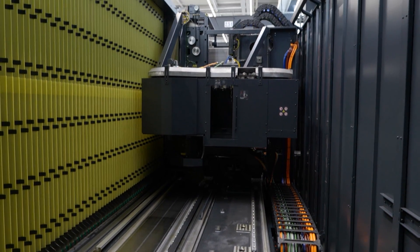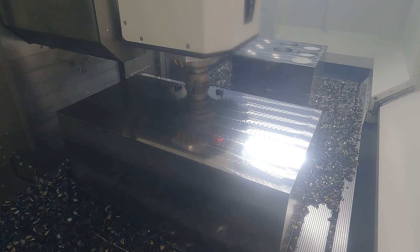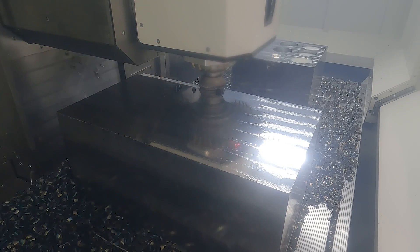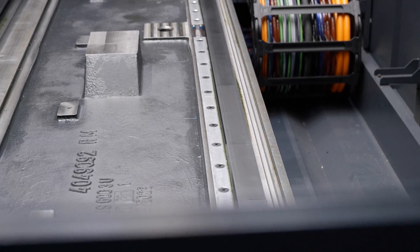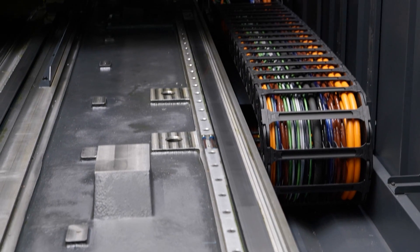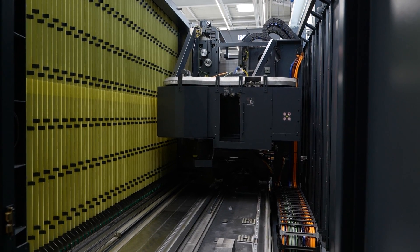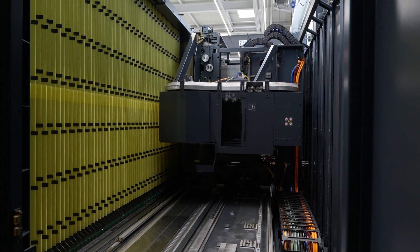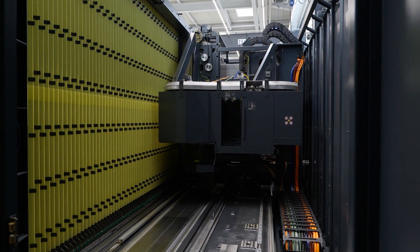You can see the massive construction of the traveling column. The Y-axis moves the whole casting in and out, which is why you don't get that droop we talked about. One final point: the linear drive motor technology. The X-axis is driven by linear drive as standard - 42 meters per minute feed rate, so no ballscrews in that axis. Only ballscrews in the Y and Z axes.